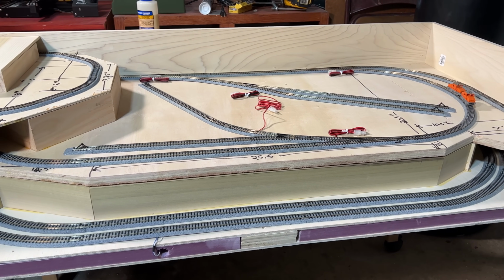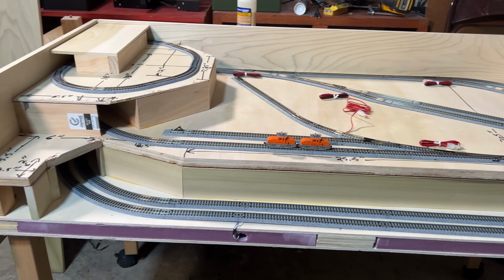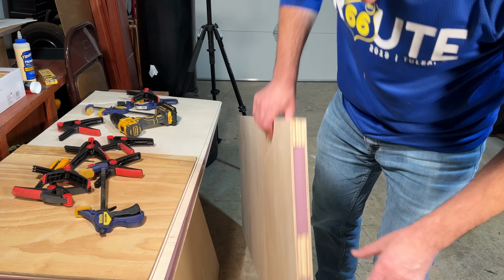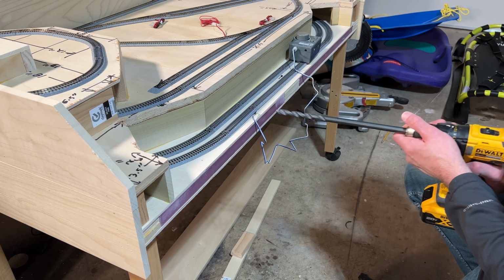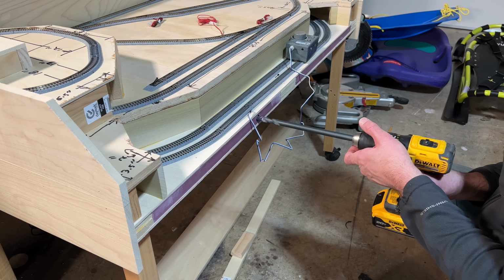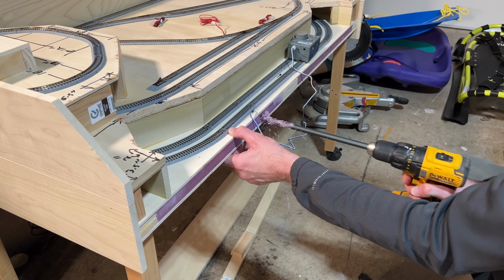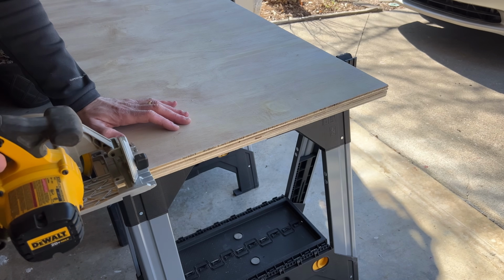I use birch plywood since that usually weighs less than regular plywood made out of pine, plus it usually has a smoother surface since it's typically used in furniture. And the foam layer makes everything much more rigid and allows for a place to run wires. And I probably should have cut channels for the wires ahead of time, but it was easy to come back later on and drill some holes with some of my long drill bits. If I was doing this again, I probably would just end up using a 24-inch wide hollow core door and cut that to length, and then maybe fill in that cut end with some pieces of plywood or dimensional pine or something like that, and that would make everything a lot easier to do.